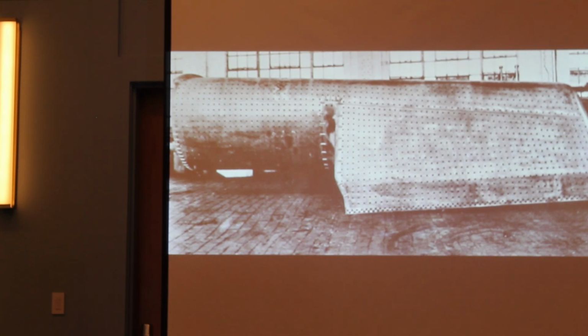And for labor, you need two guys, a welder and a helper. And the helper typically has the crappy job. He has to follow up the welder, chip all the slag off, and also usually with a grinding wheel, grind off any imperfections or if there's any gaps or anything like that. He has to grind that out so then the welder comes back and does another pass. You're going to have several passes with the weld to make the sheet, at least as a minimum, as thick as itself or slightly thicker at all the weld joints.